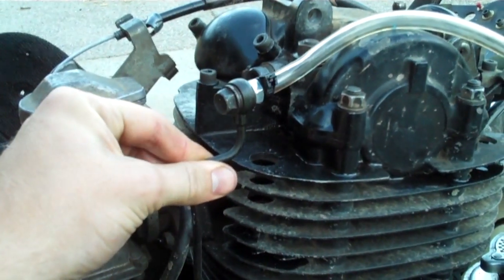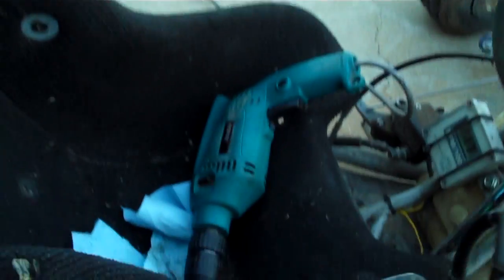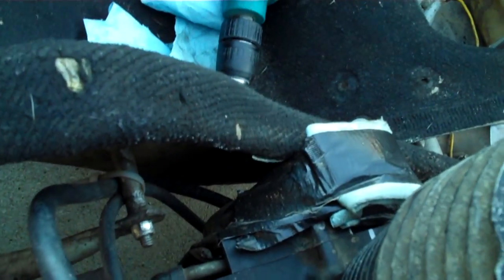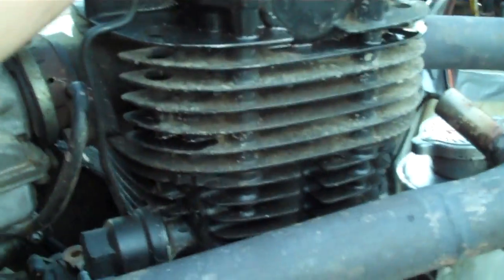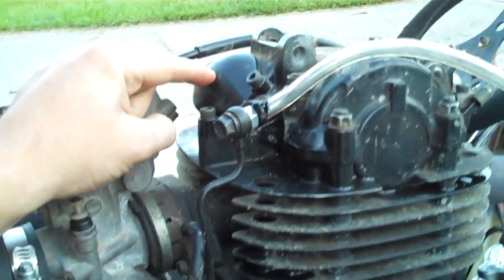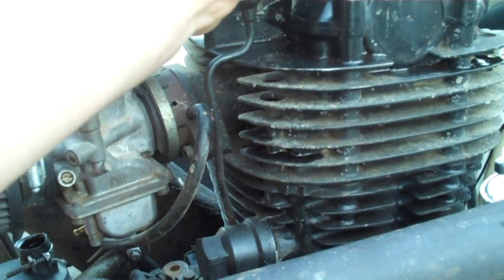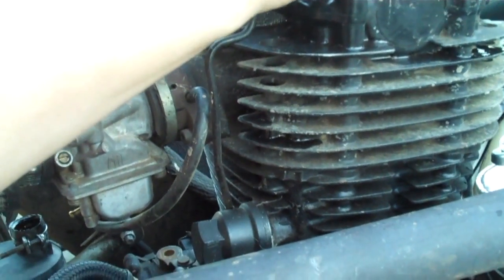What I have going now is a clear line coming off the cam pressure fitting. I put a drill into the crank and turned the motor over to build oil pressure, but I wasn't getting any oil through this line. I kept adding more oil through the cam cover into the crankcase until I started getting oil through the pressure line.